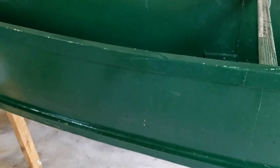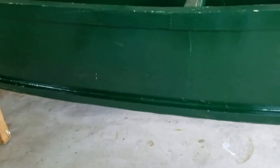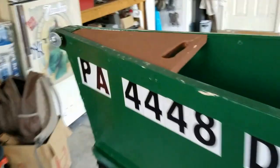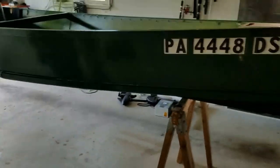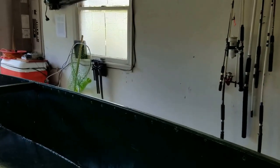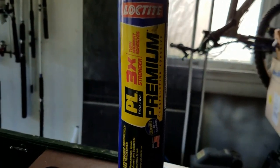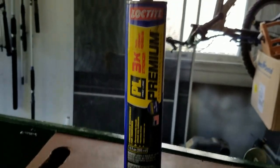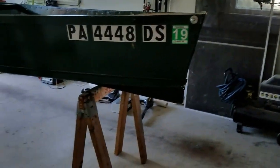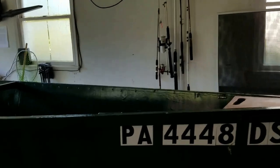So to summarize: it's all built with quarter-inch regular plywood, glued and screwed. For the glue I used PL premium — pick it up at Lowe's or Home Depot, it really holds well. It's very inexpensive. I picked up a lot of tips from boat-building sites. Some people are very big on using epoxy, but since this boat isn't going to be sitting in the water all the time, I decided to use the PL premium and it worked fine.